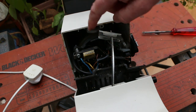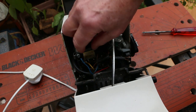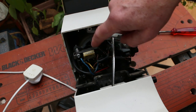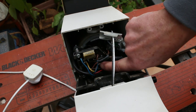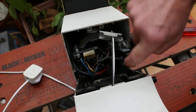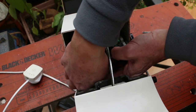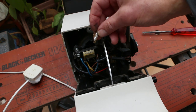Now we can see what looks like the offending problem — it's probably an X2 capacitor that's lost some of its plastic. I'll just have to check what wire goes where. I'll also check which other components may be a bit brown, if any, but it's probably going to be a case of just changing out these two capacitors. Yeah, looks as if it might have gone bang.